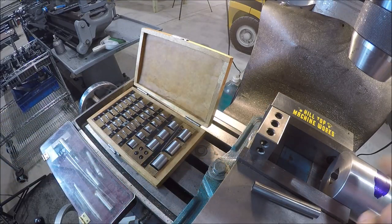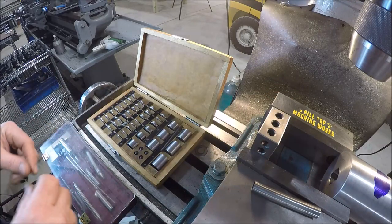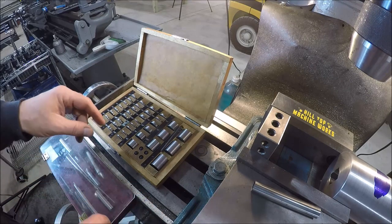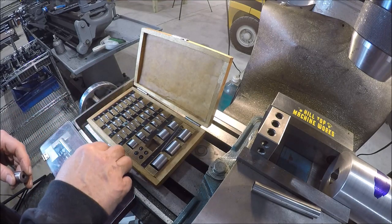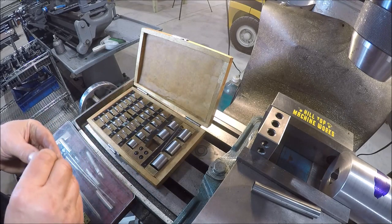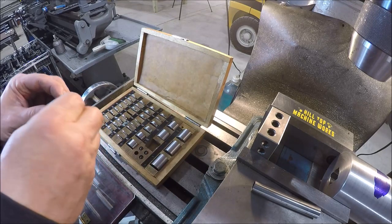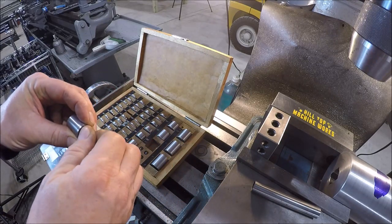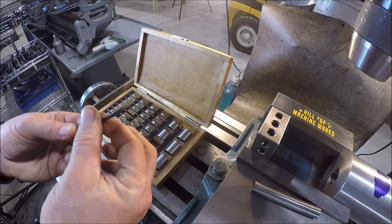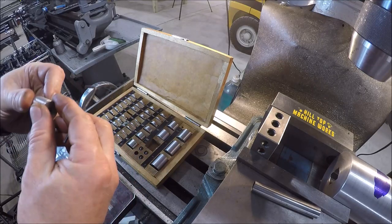So this diameter is 2.929, just under 3 inches after we skimmed it. Got a 1-2-3 block at the 2-inch mark. So basically we need to make up close to 929. And I'll tell you what, let's do 800 thou and we'll do 120. So that gives us 920. That gives 9 thou short, maybe for clamping force. It's good to have all these little kits and blocks and whatever else in your arsenal. Get that below flush so she's good to go.